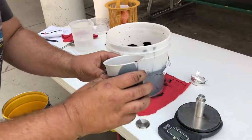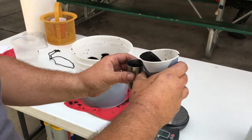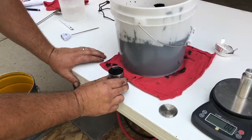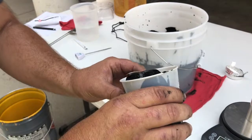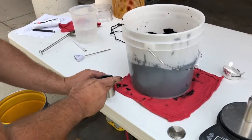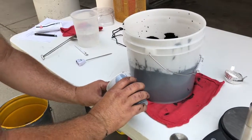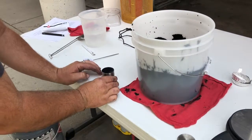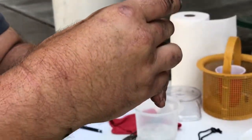Fill this cup all the way to the top with the material. Give it a few taps because air can get trapped in the sealer. You can tell the volume goes down just a little bit. Once you've got the majority in there, put the cap on — the little hole will press the excess amount out.